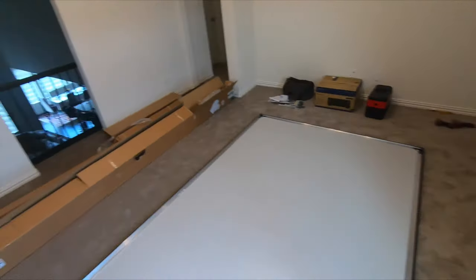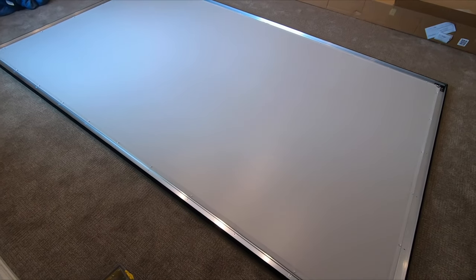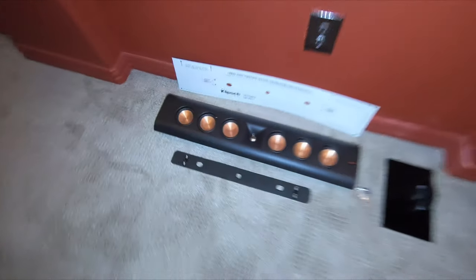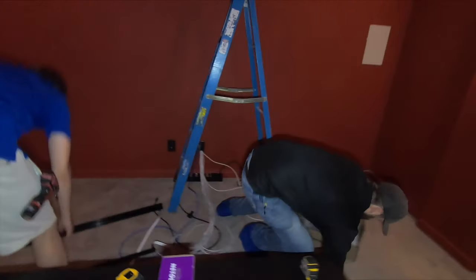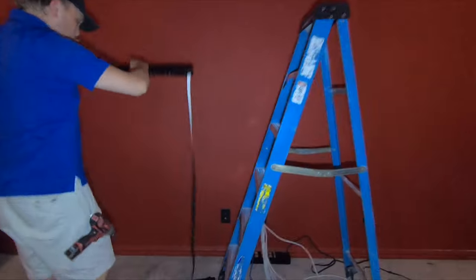That's 145 inches! The guys did a great job getting that put together. This is a tab-tension mount — see how they've got the steel rod going through here. That way it ensures that over the life of the unit there's never going to be any sagging or wrinkling, unlike some cheaper options where you get a little wrinkle between the tab points. We're prepping to mount the bracket into the studs on the wall. We measured everything out to ensure it's going to fit properly in relation to where we're going to mount our center speaker, the RP640. Cory is working on toning out the lines and labeling them — you can hear it coming from the speaker. We'd label that one a high rear, and he's going to go through the entire room and do that to all the speakers.